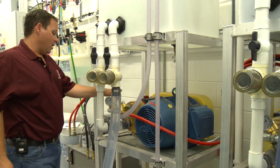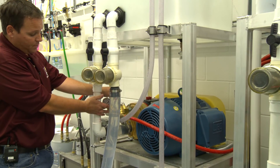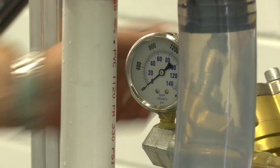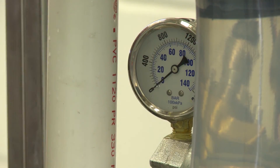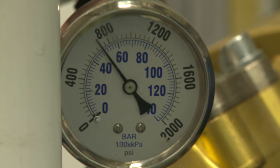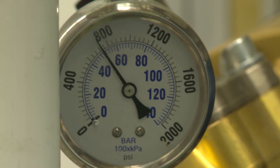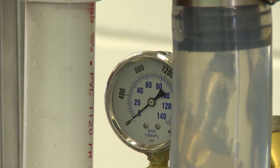We also have our regulator over here. This is where we're going to increase or decrease the pressure on the pump. Our pressure will be shown right here on the gauge. Typically, the omnis or spinners are going to operate somewhere between 600 to 800 pounds. To adjust the pressure, we simply release our jam nut, get a one-inch wrench, and put it on here. Going up will decrease the pressure; going down will increase the pressure. Adjust to the reading you're looking for — somewhere between 600 and 800 pounds. Once you've achieved pressure, snug back down your jam nut to hold it in place.